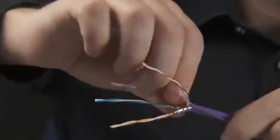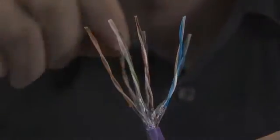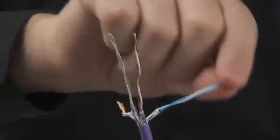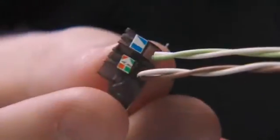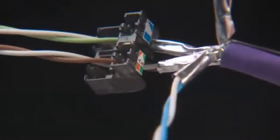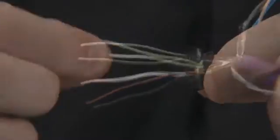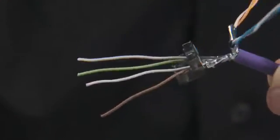Take the cable and, depending on the wiring standard to be used, cross over pairs if necessary. Feed the twisted brown pair and green or orange pair through the apertures until the foils touch the edge of the block. Now untwist the pairs and locate into retaining grooves, ensuring wires run parallel through the block.